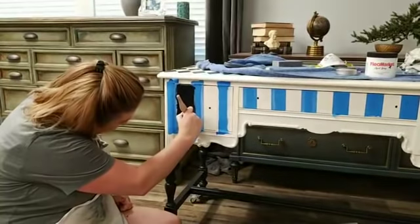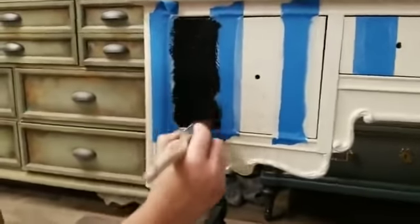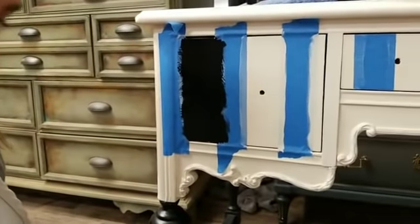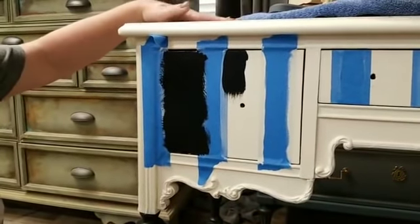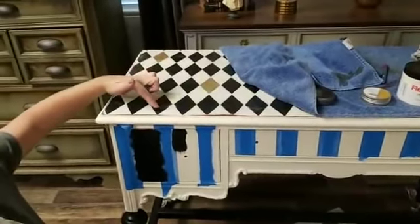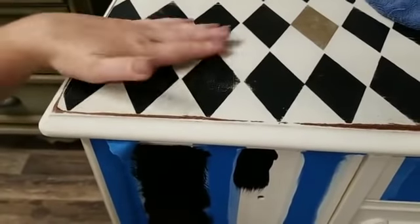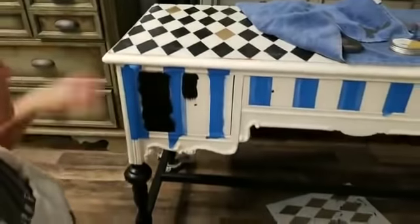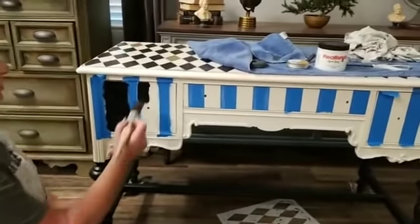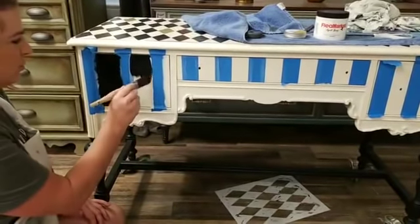Okay, so I don't want to get down here. So again, having this flat, small brush is really nice. And another thing is I'm going to distress these stripes. So I am only going to do one coat on this, and if it doesn't get coverage in places, that's okay, because I'm going to come back. You can see, if you want to come up here to the top for a second, let me uncover this a little more. You can see spots in my Harlequin where I've sanded through the black and the white is showing. I'm going to do the same thing for the stripes. Just age it a little bit. This has a coat of Gator Hide on it too, so it's really nice and smooth. And so when I sand it down, there can be little ridges along the edge of your stencil, or in this case it will be our tape lines, and sanding it smooth, I get that aged look and I get a nice smooth front.